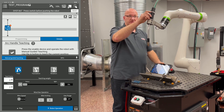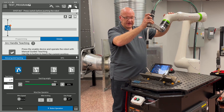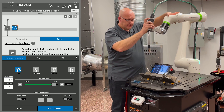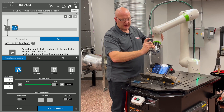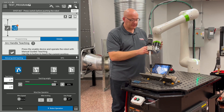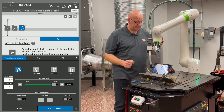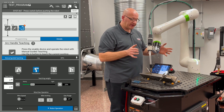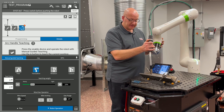Using the dead man switch held halfway down puts us in free mode, letting us move the arm freely. We'll record a home point here with a quick left button press for an air point. Then move to an approach point — this ensures the robot clears parts and clamps before reaching the weld start. Press left button momentarily to record it. Then hit the right button to switch to Translation mode so the torch angle is maintained as we move down to the weld start position.